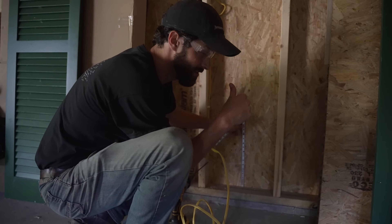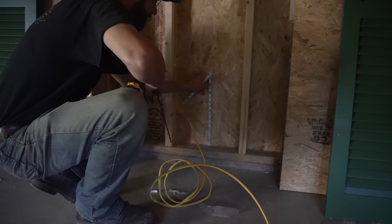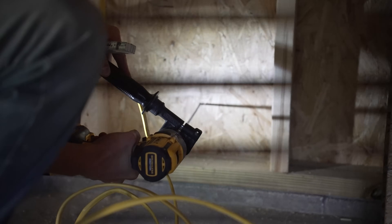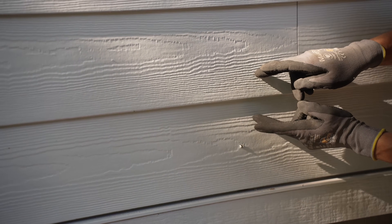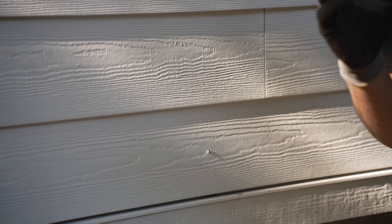My reference point from exterior to interior is the top of the concrete block. I have an inch and a half wooden sill plate, so I'm going to be at a total of four and a half inches off that sill and I'm going to drill my hole. The hole came out exactly where we wanted it — middle of the lap. If we had fallen right on the lap, we would have had an awkward placing for the box with the potential for water infiltration. We don't want that.